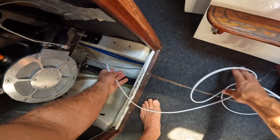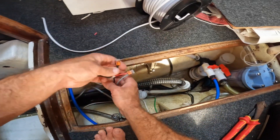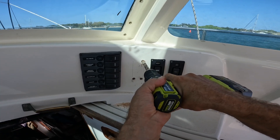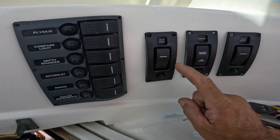I've also got another deck wash switch that I'll put out in the cockpit. I probably like electrical more than most anything else on the boat, but running cables is a pain. I've got a cutout template with the switch - love something that comes with a template. I marked up where I needed to cut, drilled some holes for the corners, cut out the section, wired up the switch, and installed it. It's got its built-in fuse and it's the right size, which is very convenient.